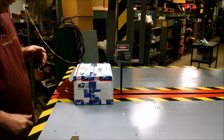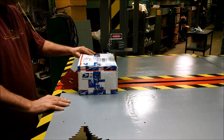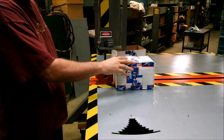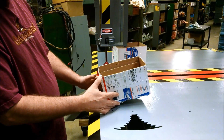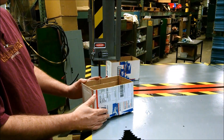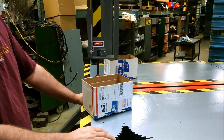I've got a cardboard box. A lot of people have these filled with foam or scrap and they need to cut it up. Now you can use a variety of different blades. This is a 20-tooth-per-inch blade, so it's a rather fine blade. You can use bimetal blades to cut wood, pallets, nails, just about anything you want to cut — except this isn't really designed for cutting heavy steel. You can put an aluminum blade in here and cut aluminum sheet, plywood, trim pallets, things like that.